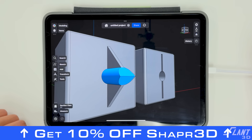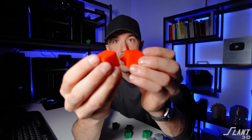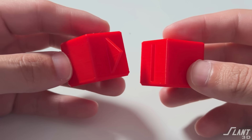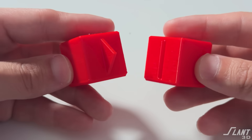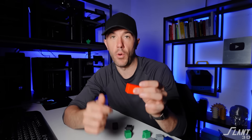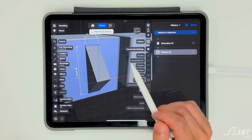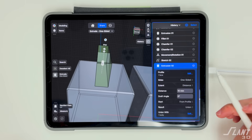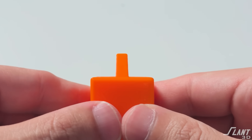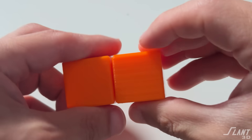But why use a circular pin at all if you've already chamfered it? Just lean into it and turn it into an actual slot. With a slotted design, the side compression of the hole is the only thing interfacing with the tab, and you can really tune the fit. To make it robust across different materials, make the slot and tabs thicker, then chamfer the tab slightly so the top is narrower than the hole entry and the bottom is wider - so as you insert it, it gets tighter and tighter for a really good fit.